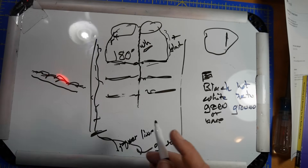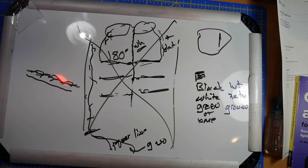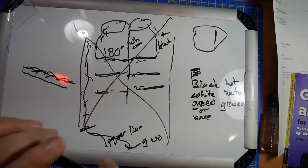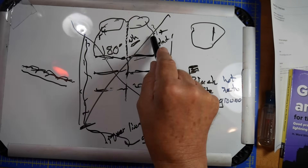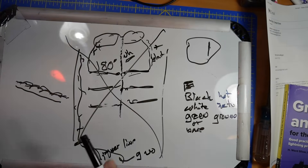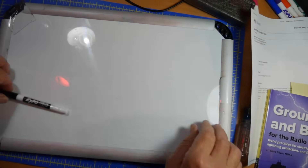The incoming service wires are aluminum. They attach to special terminals in the panel that can handle aluminum-to-copper connections. If your house is wired the old way, be careful: you have two hot breakers, and if you max out both, you can have a lot of current on the neutral and it can cause issues. I'm not an electrician, so if I got anything backwards here, please note it in the comments. For your 1930s home, check all of this with a qualified electrician. If it was rewired years ago, it almost certainly used that red-wire technique.